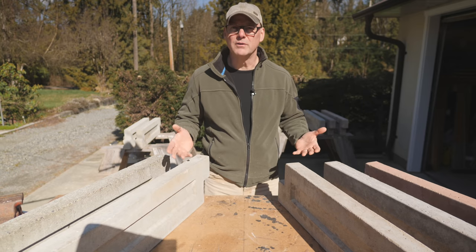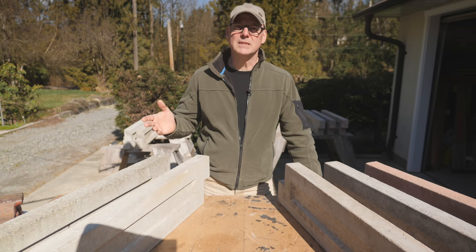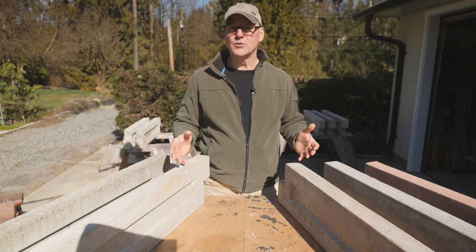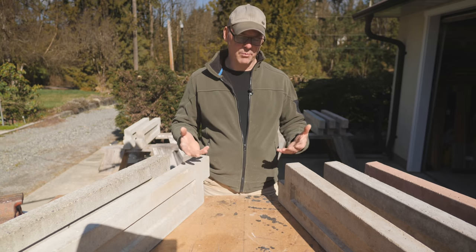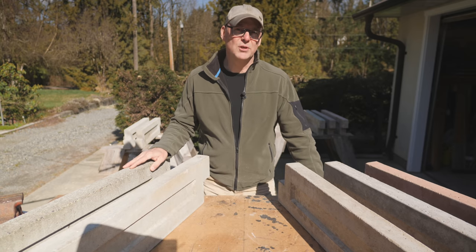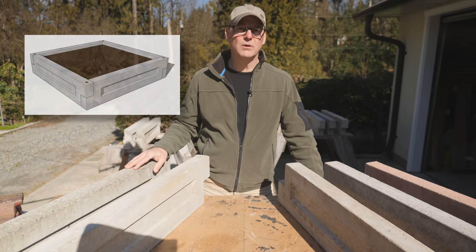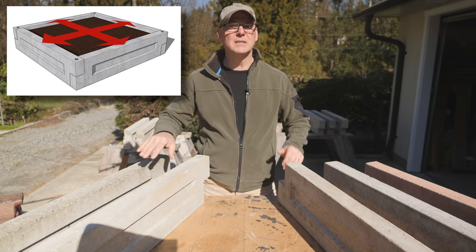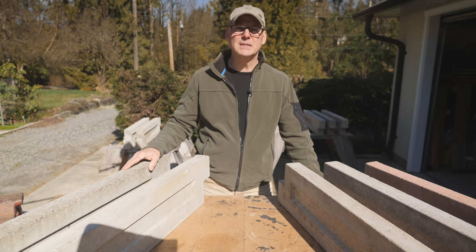Concrete is very strong under compression, but typically weak under tension. That's one of the main reasons to add wire reinforcement while you're pouring concrete. Now like the line trimmer test, this is not scientific, but I wanted to see generally how the panels fared under a sideways load. These tests are designed to simulate the pressure the soil would exert against the garden box, or how the frozen soil and ice in the garden bed may expand in the winter and push against the inside face of the panels.